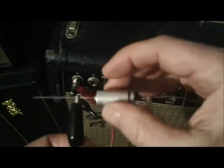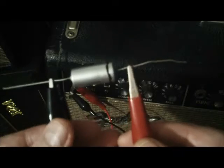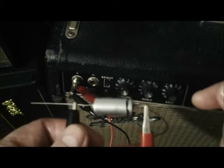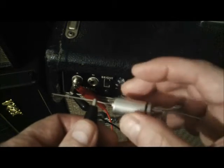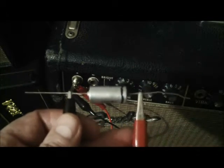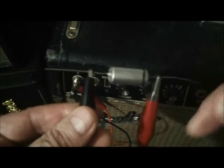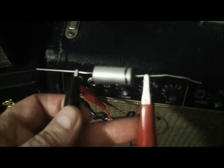Now we're going to turn the amp on, grab the capacitor, and we get a hum. That confirms that with the hot side of the amp on the lead connected to the casing, it's picking up my fingers touching it. That means this side here is the side connected to the outer foil. If you turn these around the other way, you wouldn't get the hum.